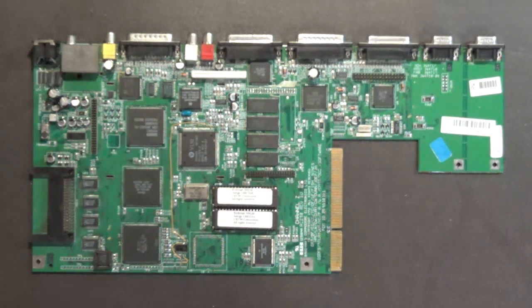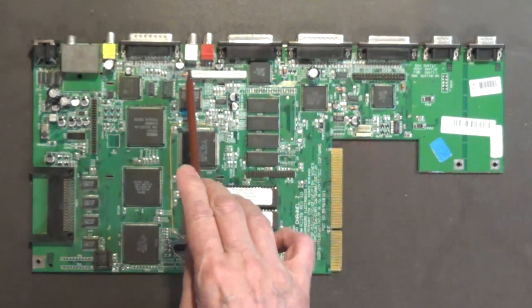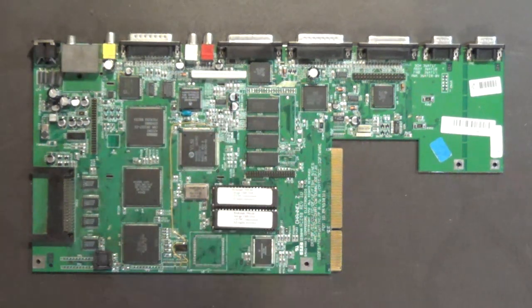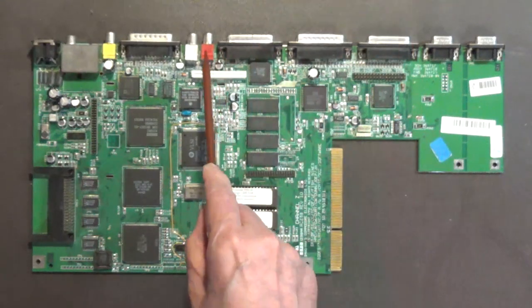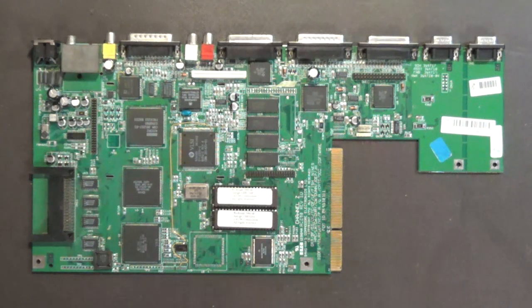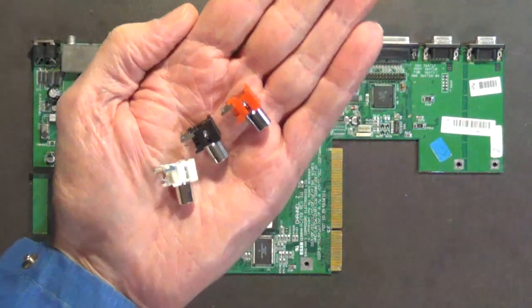And so by taking Kapton tape and wrapping it around that plastic part right there, that'll help keep you from melting that connector. And then since you gotta unsolder these two parts anyway, you might as well solder on brand new parts, and you can get those on eBay as well. I have them right here. I have brand new parts right here. I'll show them to you. But yeah, these are brand new.